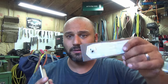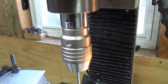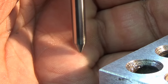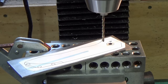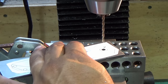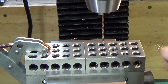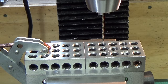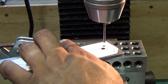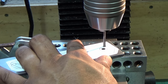So we drill the pivot — let's drill out that stop pin hole for a one-eighth pivot. We're going to start our hole with a number 31 drill bit, and then of course, like always, we're going to ream to size. Hopefully you can see something in the frame. Now we're going to swap out to a .125 reamer — this little carbide chucking reamer, 1250. Nice slow speed on the drill press or the mill, whatever you're using, and let the reamer do the work.